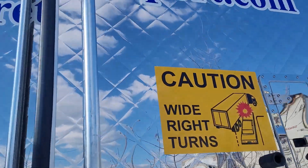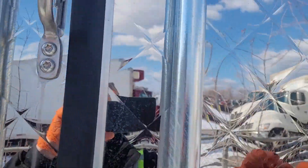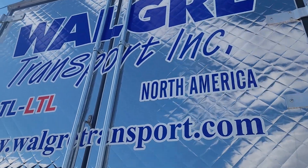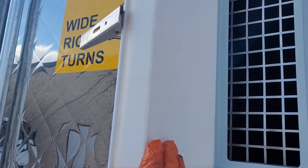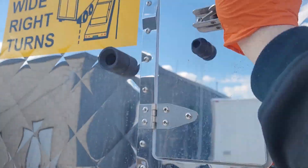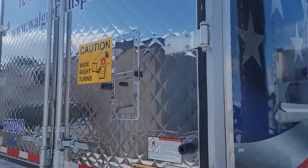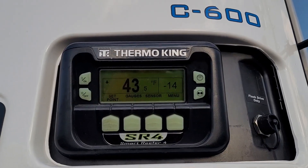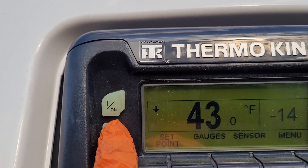We want to make sure the floor is clean with no debris, because it will clog the drain valves. You also want to check the seals around the door — make sure there are no broken seals. Check the vent as well, and do a general overview of the whole back of the trailer to make sure it's closed properly, since we're trying to maintain a temperature. And that was a pre-trip to check the functioning of a reefer.